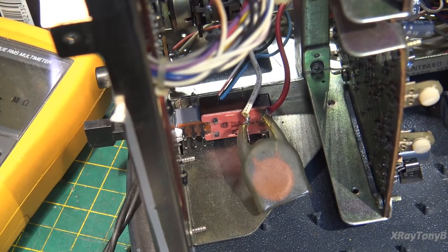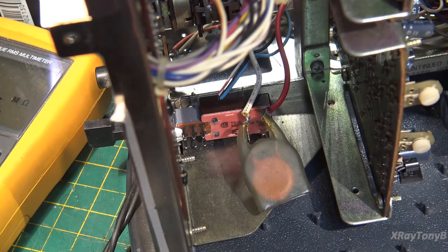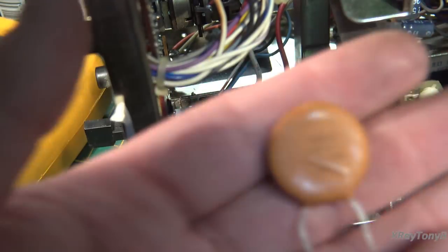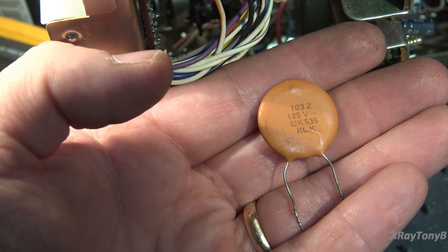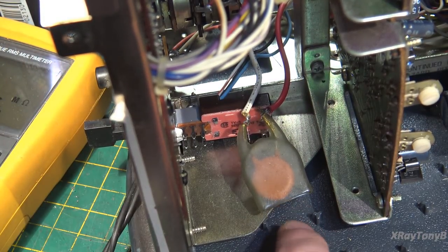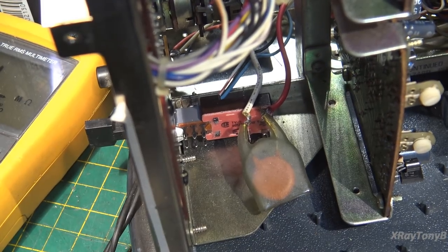The switch is installed back in. The contacts on one side were too far gone to clean — they were corroded and the plating came off, so there was no way they were going to make good contact for very long. I just moved all the terminals over to the other side. I also removed the original ceramic across-the-switch capacitor — it was only rated at 125 volts and was not a proper XY safety capacitor. I swapped it out with a proper XY capacitor rated at 400 volts. We have continuity — it's very good. We should now have power to be able to test the transformer.